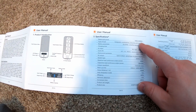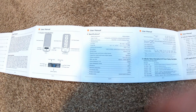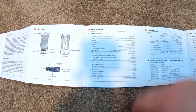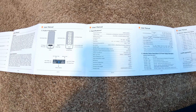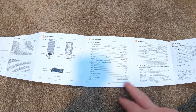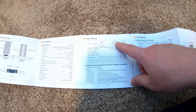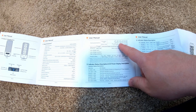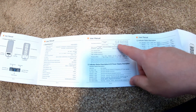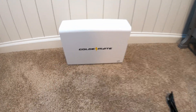It is an 800-watt unit that uses lithium iron phosphate battery chemistry, which is what I'm most excited about. It's rated to 3,000 cycles with an 80% depth of discharge. Recharging time is 10 hours or less. It is pure sine wave, which is critical. Its switching time is 20 milliseconds — we'll have to test that with my workstation. It's rated to produce 105% to 120% of its rated power for continuous use. At 120% and above it'll run for 60 seconds then shut off; at 150% it runs for 10 seconds then turns off.